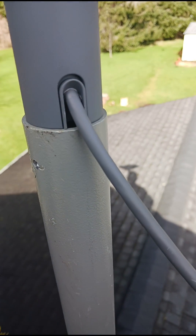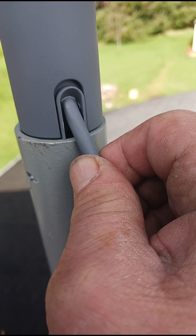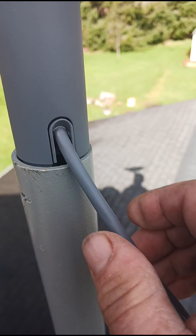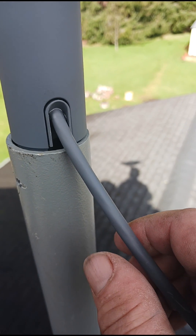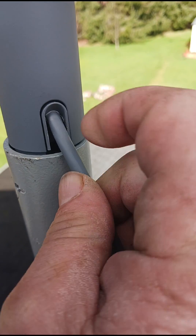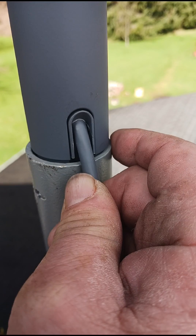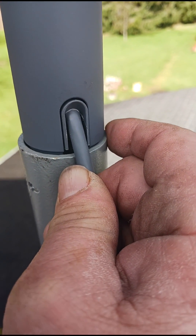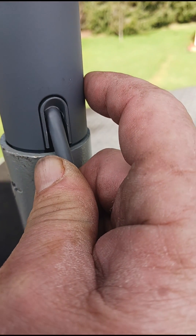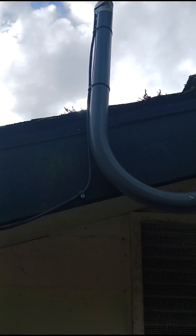Just to go over that point again — it's seated up in here but you can see there's still some play in there. That's where I believe water penetration and humidity get in. We're out here in Forks, Washington, one of the heaviest rainfall areas in the country. Once we get this seated and mounted, I'm going to take some waterproof tape and seal that up. Do not squirt sealant or silicone inside — you can foul your fittings. Just a nice wrap of waterproof tape around the outside should help avoid that humidity issue.